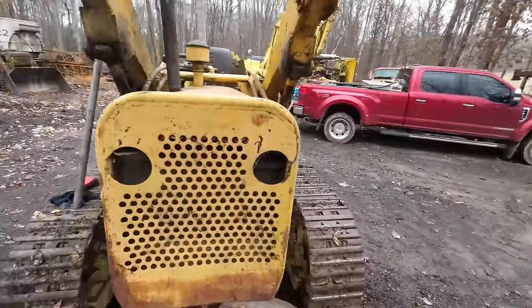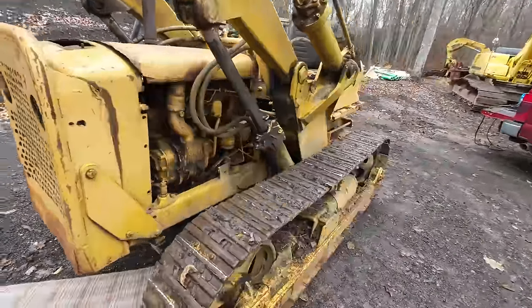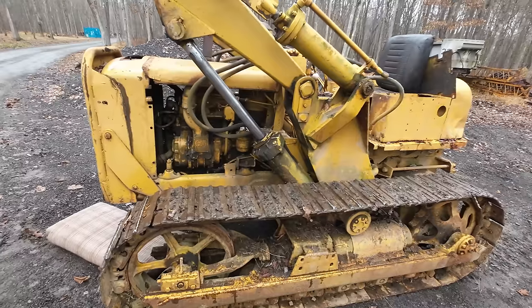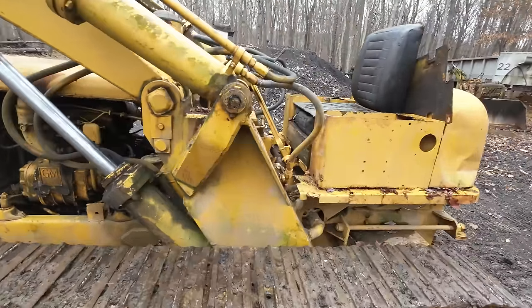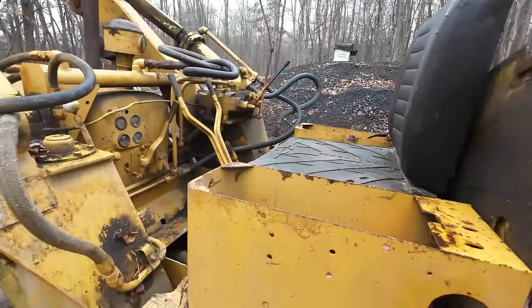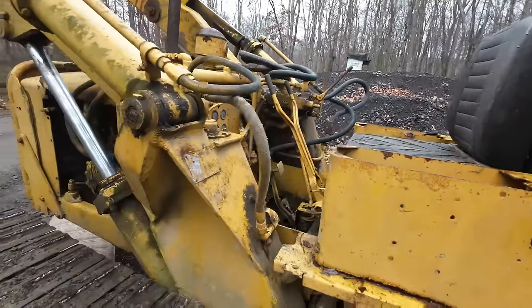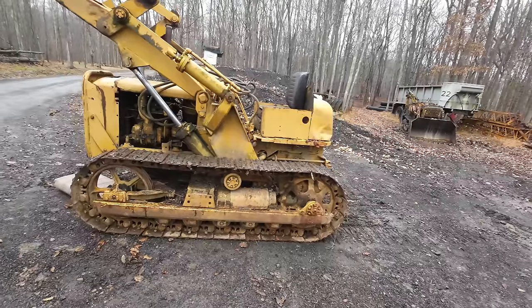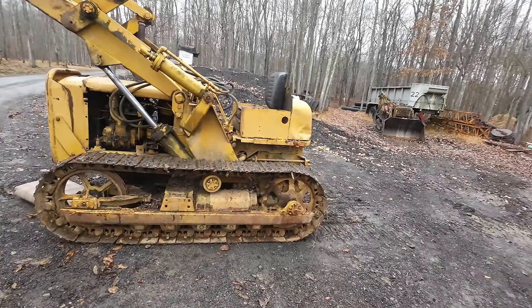Now that that fuel leak is fixed, though, we should be able to just drain the oil out, put some good stuff in it, and be pretty well off. That might also jump our oil pressure up. If the oil's that thin, that could be why we're not registering on the gauge, but it was pumping up to the rockers. It's not like it's actively pouring out of the bell housing now either.